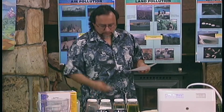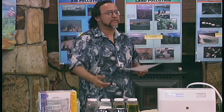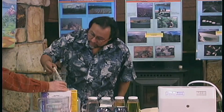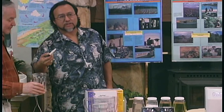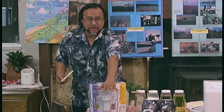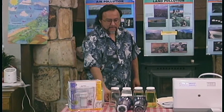Can we check our filter? I'm not sure how long it's been since it's been changed. When you're talking about how over time it doesn't do the job — if you replace the filters, yes, that's the key. If you're going to use these types of filters, change them often. The companies who sell them would love it if you changed them often. He's just brought me a sample of his filtered water. What type of filter? Charcoal. So you've got 200 parts per million as opposed to 300 — that's equivalent to this type of charcoal filtration. That helped 100 parts per million, but this filter is probably not brand new and probably needs replacing.